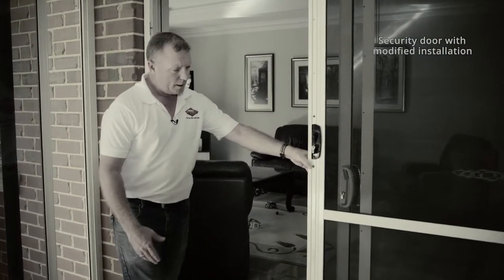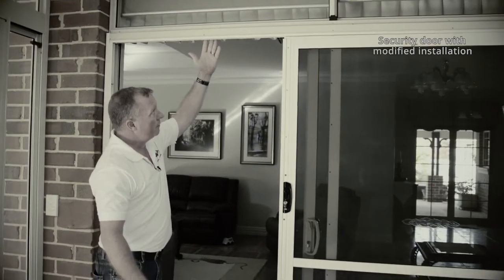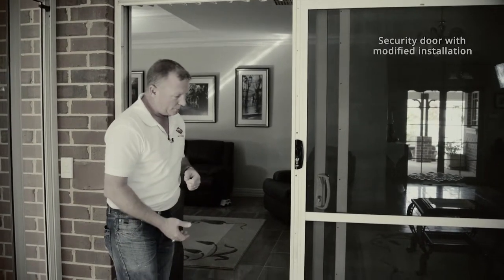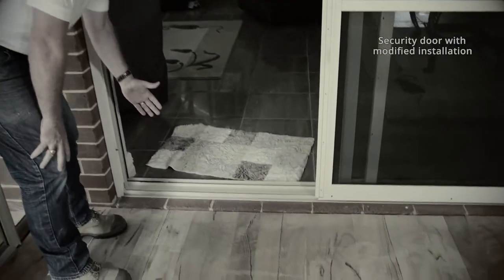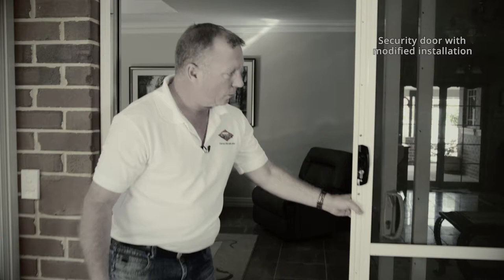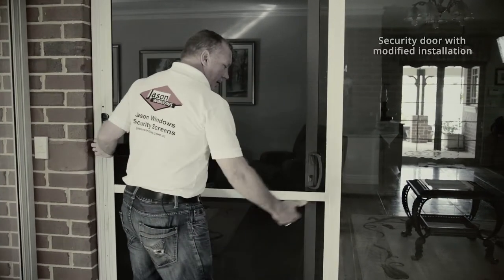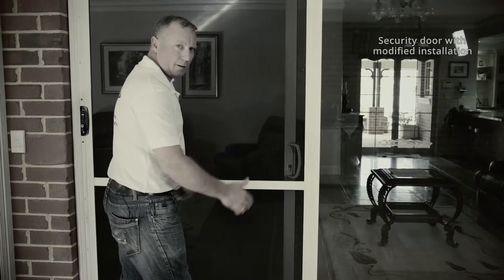It's particularly difficult to open, and that can be from a variety of reasons. The extrusions used in both the top and bottom of the door, when they've applied the security product, is not tailored specific to the Jason door. They've had to make some modifications, and one of those modifications is they've damaged our track in trying to move the security door out to prevent their security door from clashing in the closing position against this fixed panel. But in doing that, it's starting to wear out those rollers because the track's now not smooth and straight like it should be.